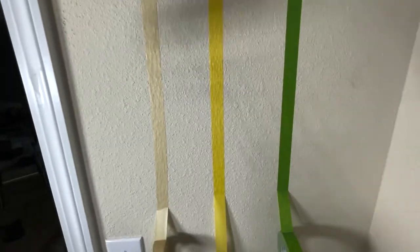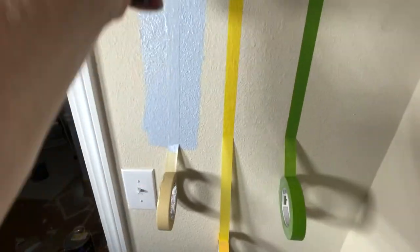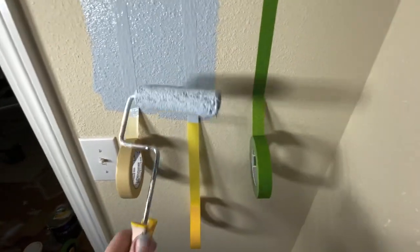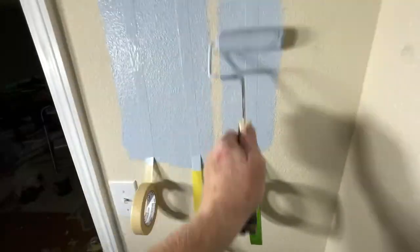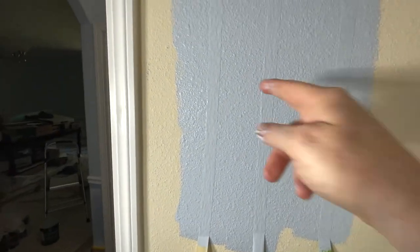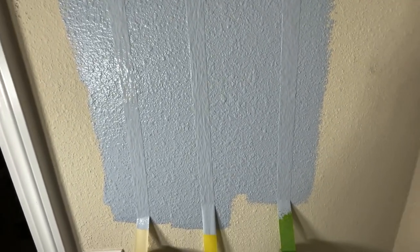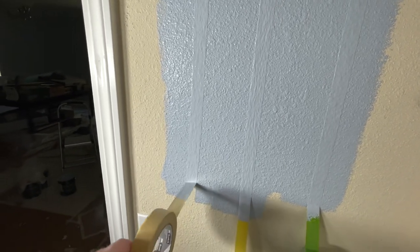And so we're going to take our typical paint roller, roll right over it with the same pressure on each. We won't count down here because it's obviously coming off of the wall, right? And now we're going to see which one served us the best. Now remember, I feature a technique on my channel of caulking the edges so that paint doesn't get underneath. But if they're going to give us a tape, folks, that does the trick without the caulking, aren't we going to take them up on it and just spend the extra money so we can get out of the job quicker? Now let's see how our 3M tape did.